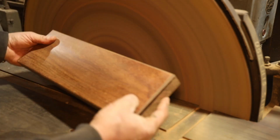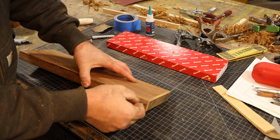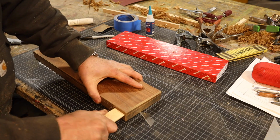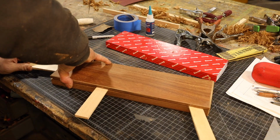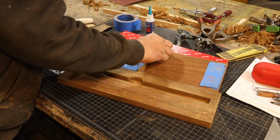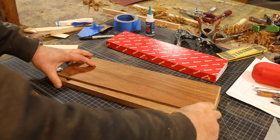And the top and bottom, I can kind of remember how I was holding it. And so now here, there's a slight bevel on everything. So now I'm breaking it apart. And I don't want to mar the edge, so I'm just gently breaking it apart and using shims to finally split the tape. Now the tape is CA glued together in there. It's like basically splitting double-sided tape. You got to be careful. If you put too much CA glue in there, it'll weep out and get inside the material.